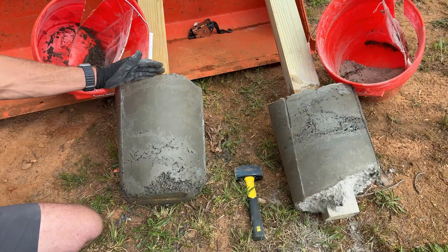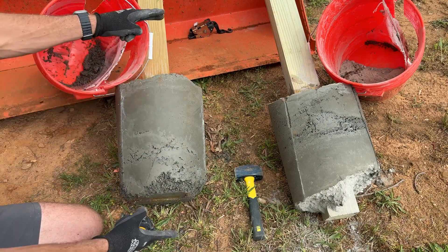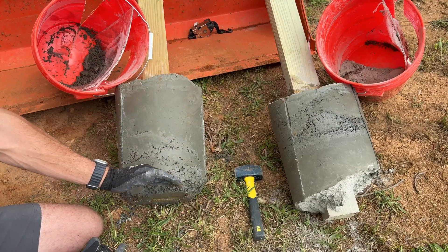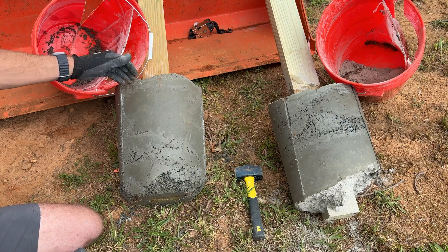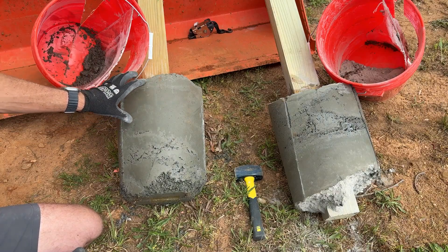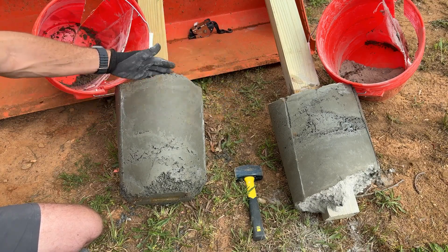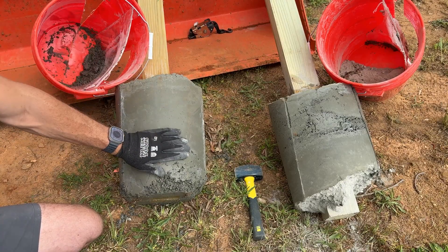This test was only about half the maximum distance they say you can do a dry pour. So if you had a full 30 inches, I think even test one would struggle to pull water all the way through — especially because these buckets are the best-case scenario where water sits on top and pulls through, as opposed to being in the ground where dry soil would start absorbing some of that water, meaning you wouldn't get full water penetration through your dry mix.